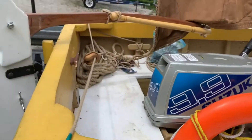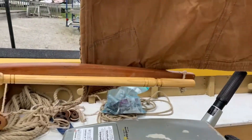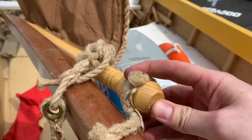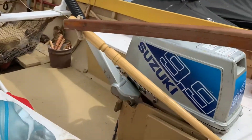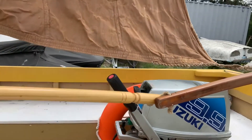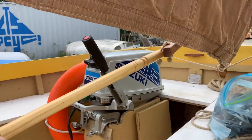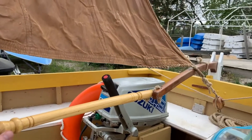Up on the tiller here we've actually got two pieces — one tied to the other — and this is the tiller extension, sometimes called a whipstaff. You just push it through the hole, and you've got a tiller extension that can move in any direction from wherever you are in the boat. You can steer no matter which side of the boat you're on, or even if you have to come forward a bit, you still have a significant amount of length to work with.